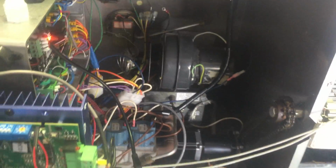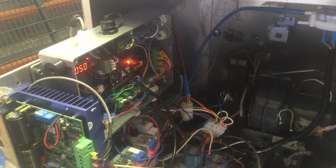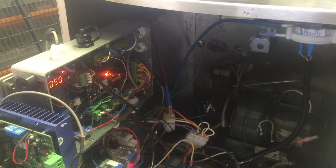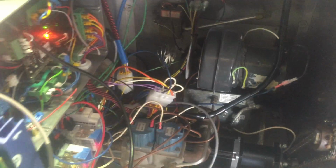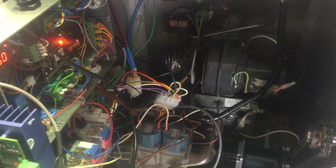If we were to increase that incoming voltage to 50 volts, you'll still get 5 volts out. It'll stay there. Because once they're in the field, we're going to find other things. Because we always do. Well, that's why I've got rid of all this electrical noise. Any power spikes, anything happens, it's all done by that little board there. So basically, it's idiot-proof. There is a switch mode power supply down behind. That's really filtered, and then you've got that one there which filters it again. So my boards are protected twice, if you like.